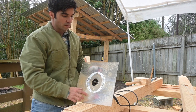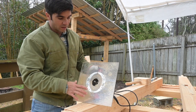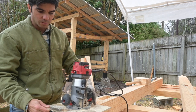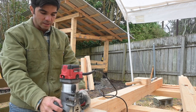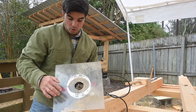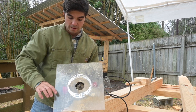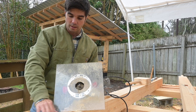I use this router with a big plexiglass plate — about twelve inches by twelve inches — and it allows me to keep the router perfectly level. These tenons get to be a little thin, so it can be hard to balance the router exactly right. The original plate that this came with is only on that metal part right there. By expanding this plexiglass, it allows the base to have more contact with the wood and keep the router perfectly vertical when cutting these reductions.